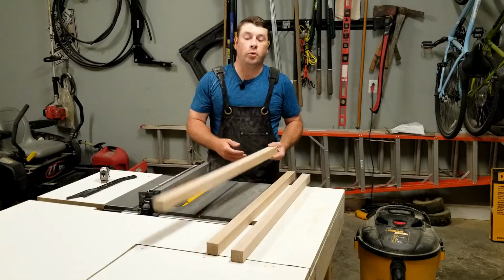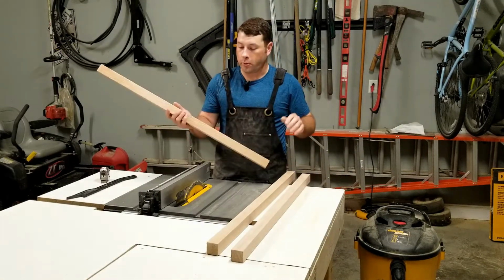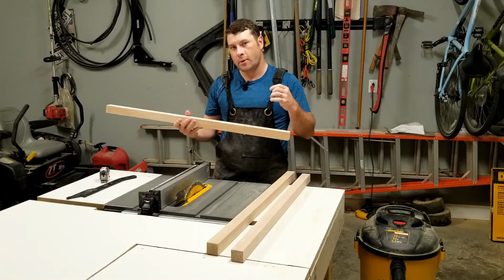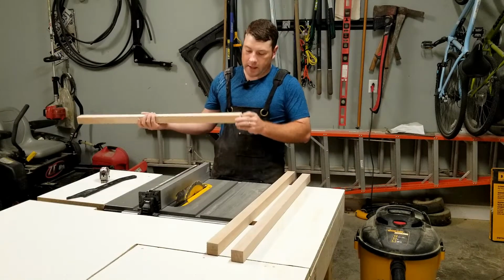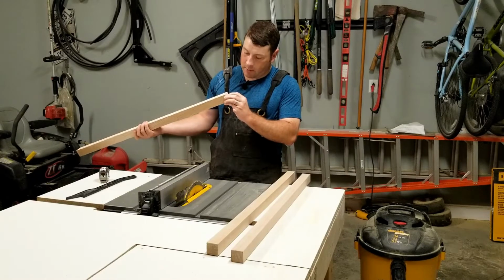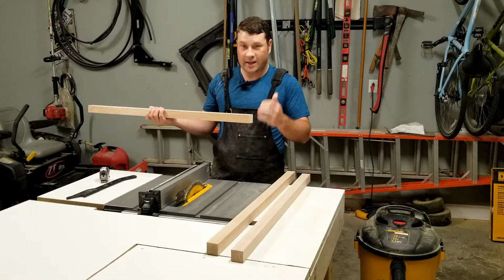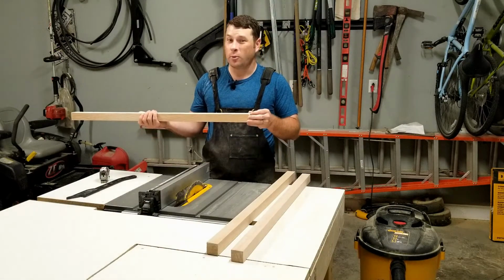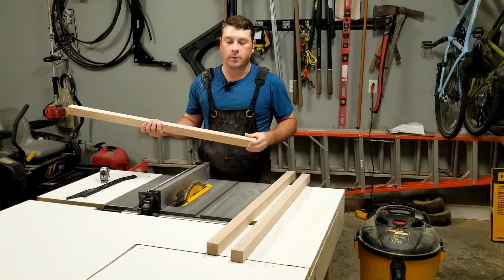Now we need to take our wood and cut a slot the entire length of the board using our table saw. This is where the actual picture is going to sit down in and be displayed on the picture holder. It only needs to be maybe a 1/4 inch at the most into the wood. We don't need it any deeper or you're going to cover up some of the picture, and any shallower the picture won't sit straight up and down. It might fall out real easy.